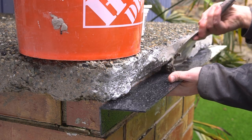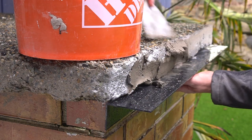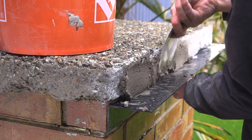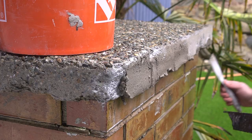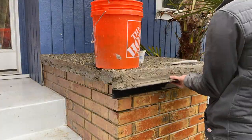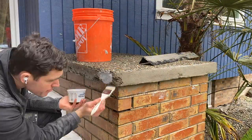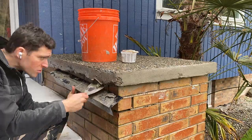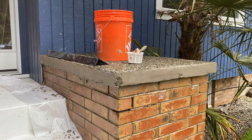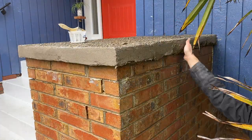It's now time to apply our cement patch. With this type of application I highly suggest getting some type of straight edge — even just a two-by-four. I'm using a six-inch taping knife to maneuver the material into those crevices as neatly and as quickly as possible. You don't have a lot of time because it sets up in 10 to 15 minutes, so work in small batches if needed. The beauty of this product is that it feels more like clay than cement, which is why it does such an amazing job adhering to existing concrete even on completely vertical surfaces. I do get my hands dirty to reach smaller areas, but always come back with the taping knife to smooth the surface.